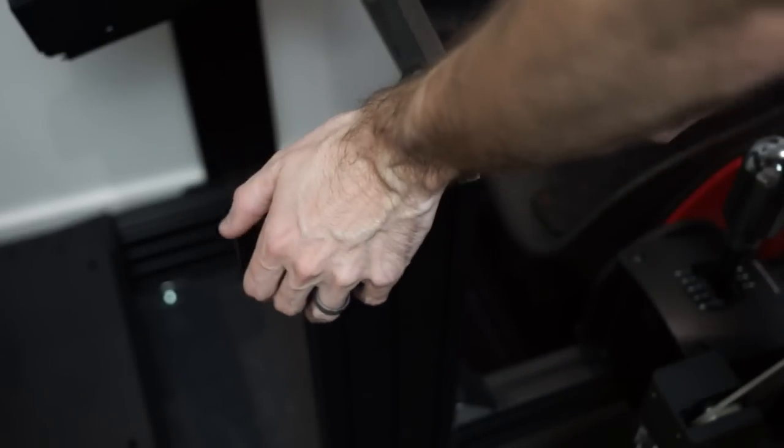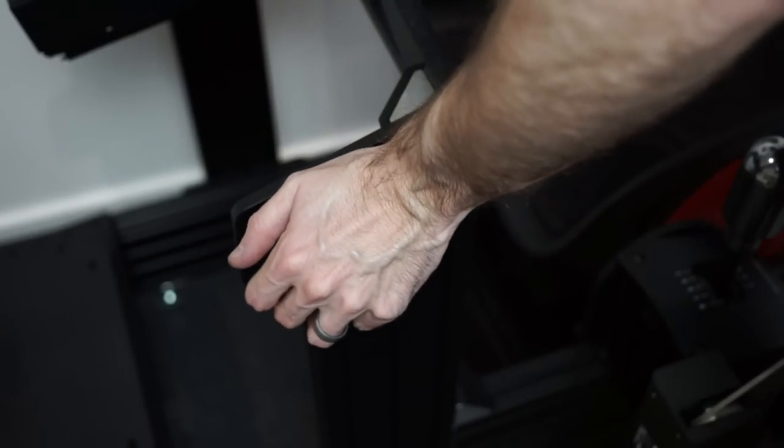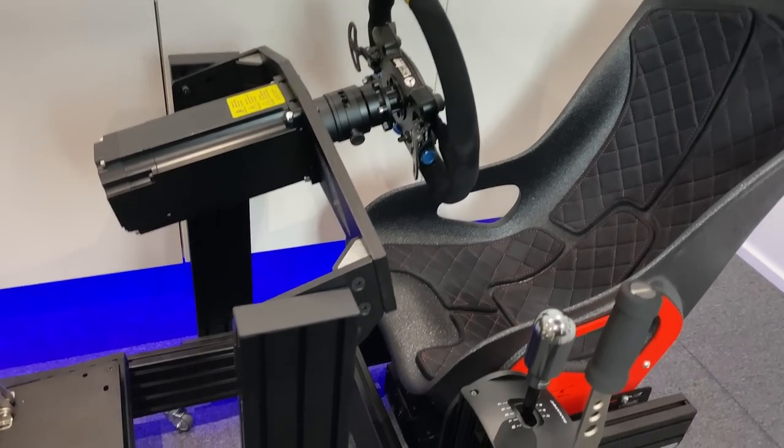Two included bolts and T-nuts to mount it onto the assembly, along with two angle brackets to fix it to the wheel deck. Pop a couple of T-nuts into the inside of the rail — it can be a little tricky to get these in position if you've already got your seat installed like I did, so if you have the option of installing your seat later it might be preferable. Then simply screw the two M8 bolts into position.